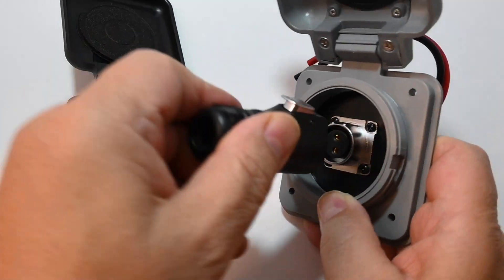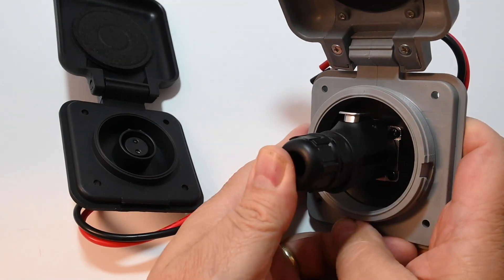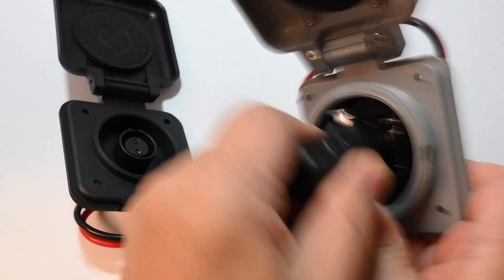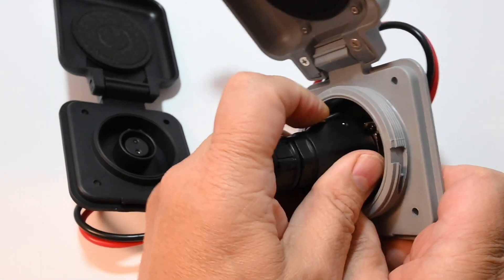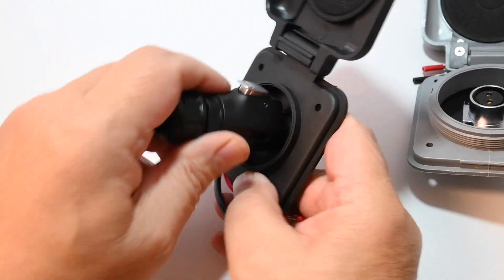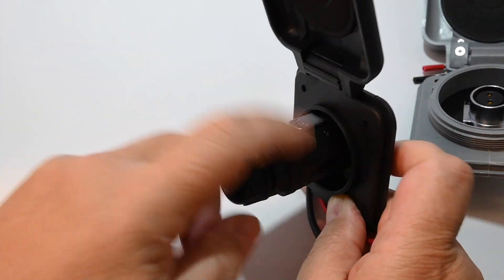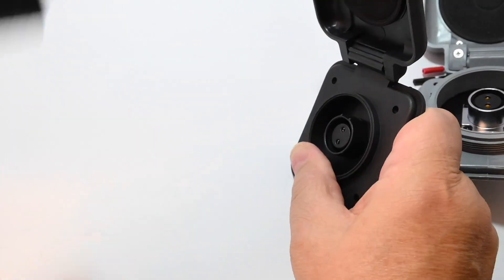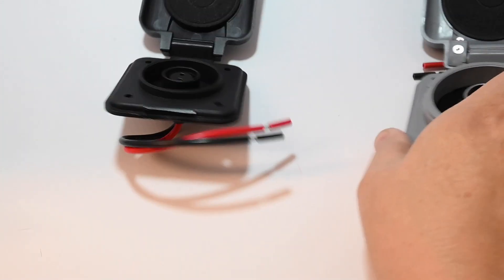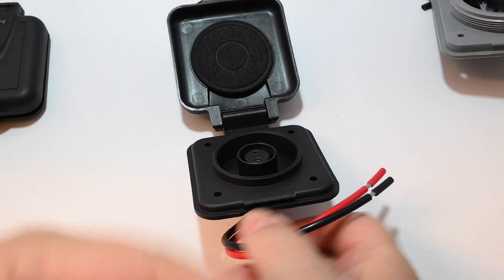Another nice thing is that when you put the CN-Linco plug on, you hear the snap — there's no way this will come off until you depress the bail. In contrast, the original connector never really fit well; you can put it on easily enough and it'll come off by itself. The CN-Linco is a much more positive locking connector.